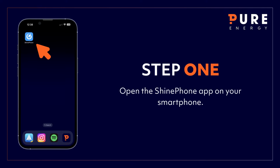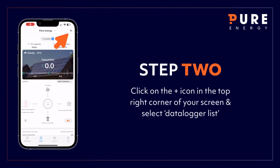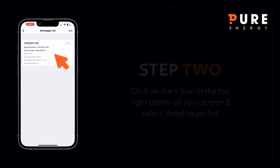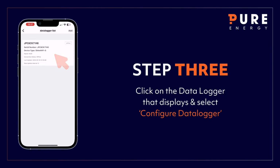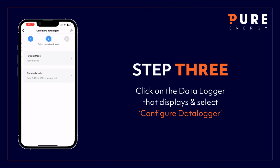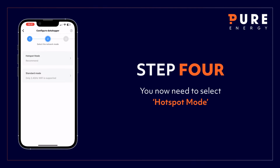Firstly, open the ShinePhone app. Click on the plus icon in the top right corner and select Datalogger List. Select the Datalogger and choose Configure Datalogger. You now need to select Hotspot mode.